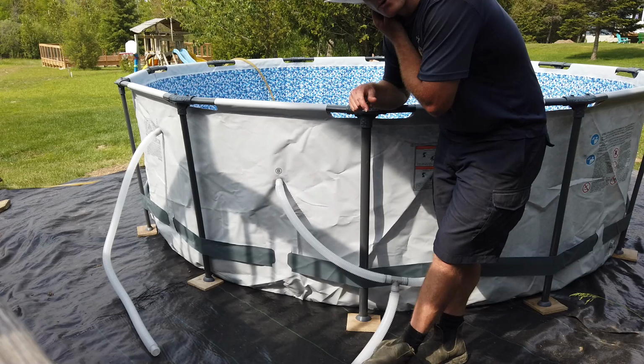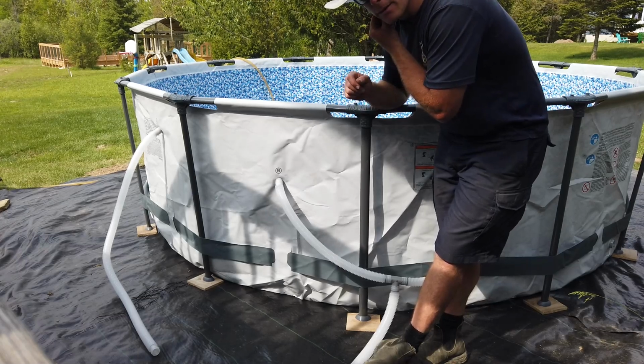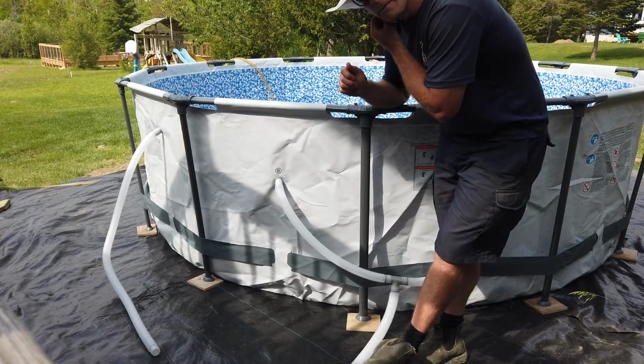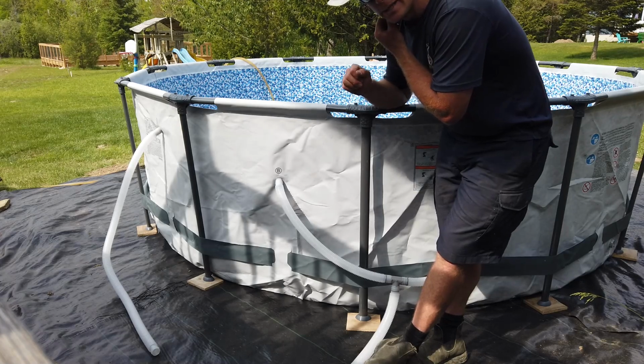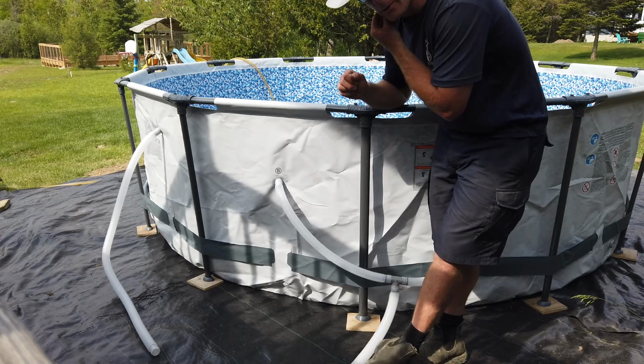I'm going to connect a hose to the shallow well jet pump well because that system will allow the pump to cycle on and off, and I can choose a flow rate that will keep the electric pump within its designated duty cycle. Just try to stay within its design criteria so I don't burn anything out.